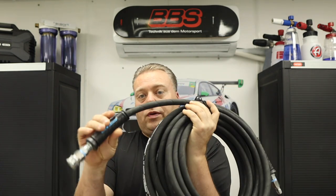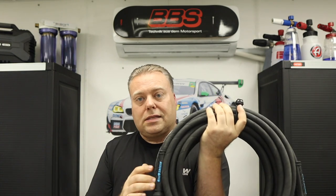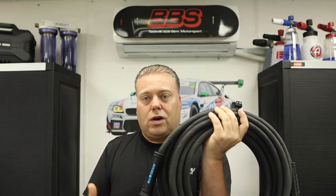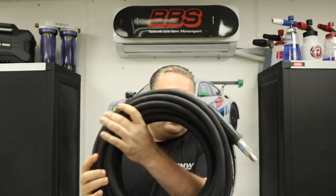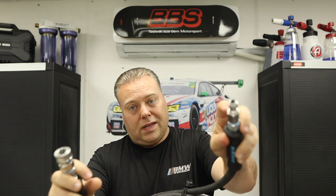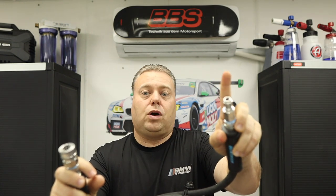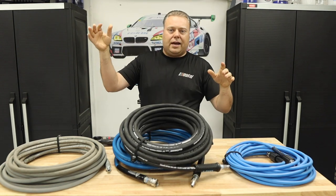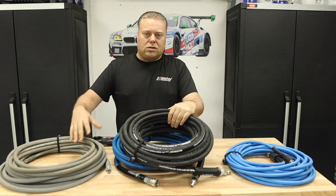Something I really like about this hose is the grip — it's really nice. If you have it in a hose reel that's less needed, especially on the side where it hooks up. The end is a swivel, just like the Essential Washer or the Cobra Jet. Both ends come with 3/8 inch NPT males. When you get your quick disconnects, you get a 3/8 inch female quick disconnect on each side. The male plug that comes with most pressure washers, I toss that to the side.